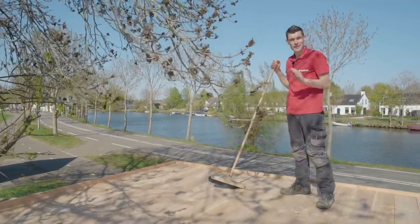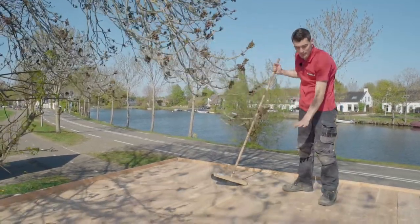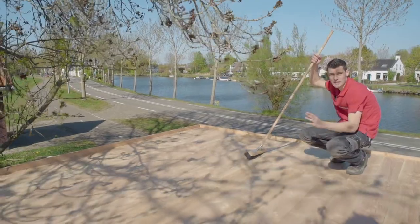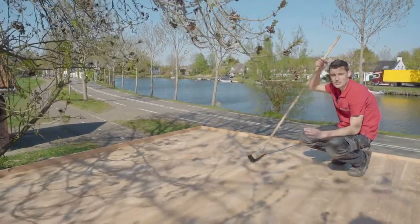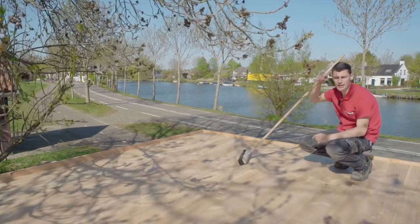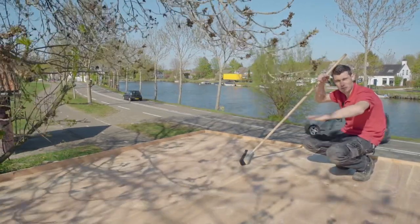Start by clearing your roofing boards of dust and debris. Our roofing boards are fine saw textured boards. You can apply your cladding straight to these boards, but an even better option would be to install a layer of battening followed by OSB or underlayment sheets, which will create a fully smooth work surface for your roof.